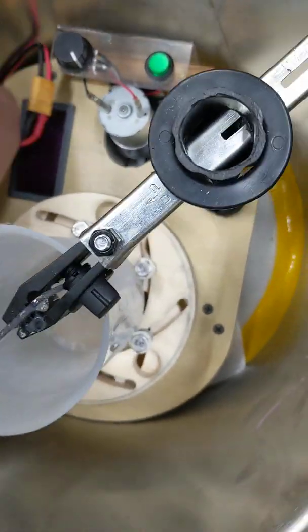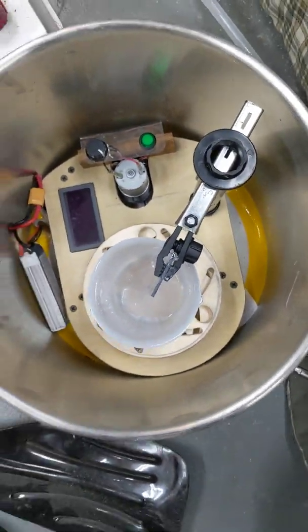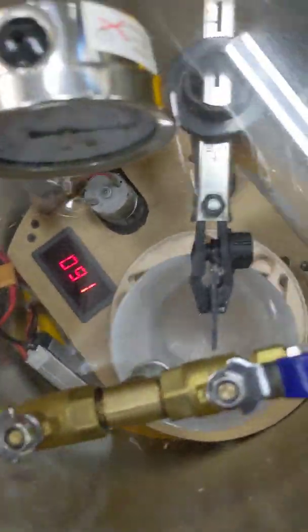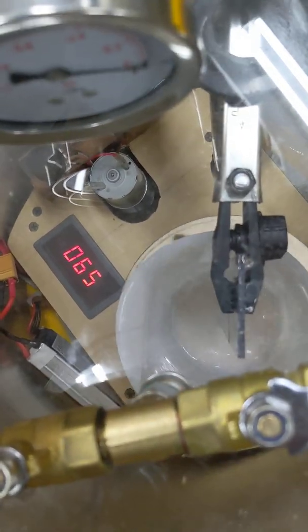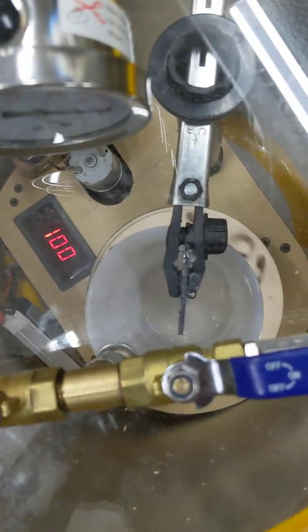Powered off. The entire assembly will fit inside the vacuum chamber, like so. So you've got your epoxy in there, which you degas part A and B separately. I have a whole bunch of videos of me doing the first test. But as you can see, the lid fits on here. And so then you take your remote, and you can remote control the mixing and speed inside a perfect vacuum. So it does not introduce any bubbles, and it works fantastically well. That's the gist.